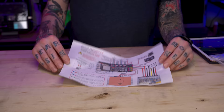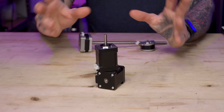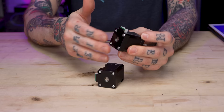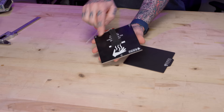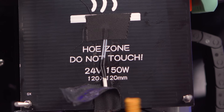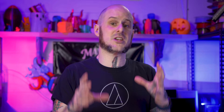The only written instructions in the box is a wiring diagram, which overall I'm fairly impressed by, but until I actually wire all this up, I can't say for sure. Our A and B motors — aka X and Y — are completely unnamed, unlabeled, no part number, no manufacturer name, nothing. Just some generic NEMA 14s. One of the places it's clear they cut some expense is the bed. This is a piece of three millimeter thick aluminum plate with what I thought was a 50 watt 24 volt bed heater PCB on the backside — but wait: Alan from the future here. Turns out I needed to peel the tape back further to discover it's actually a 150 watt bed heater. We will double back around to this because it caused me legitimate problems running this machine.